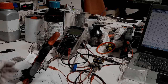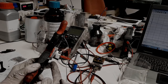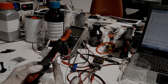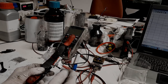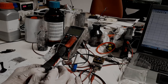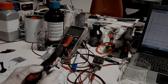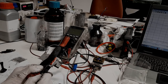So here's how this battery is made. For the negative electrode I use an aluminum plate. For the separator I use filter paper. For the positive electrode I use a graphite plate, and the active material for this battery is a mix of graphite and carbon black — I used about four grams of natural graphite and half a gram of carbon black.